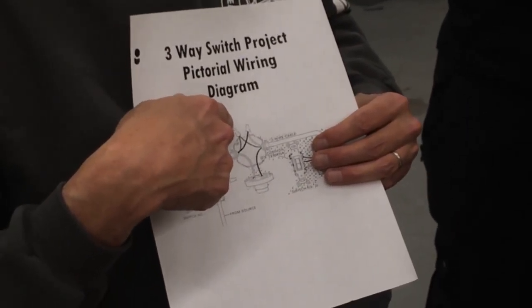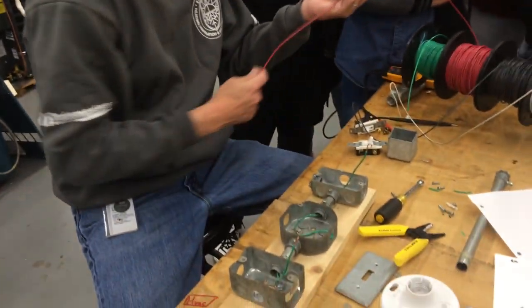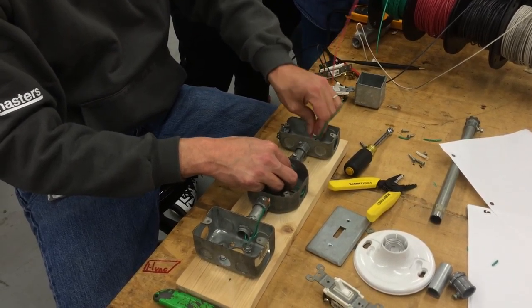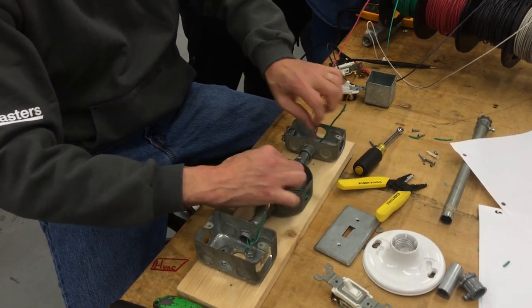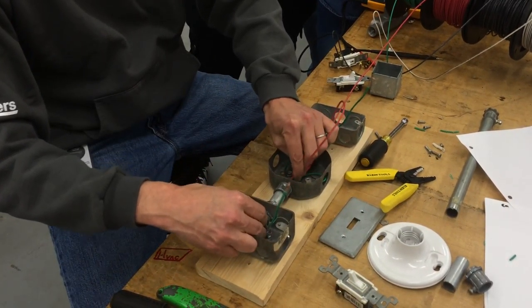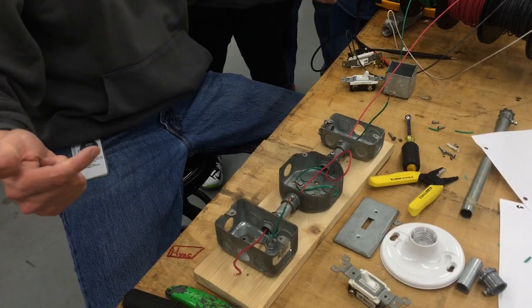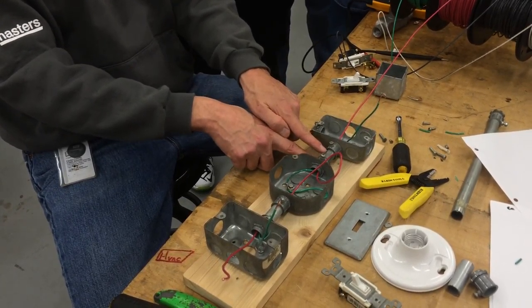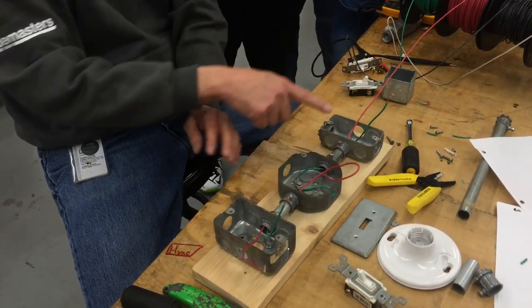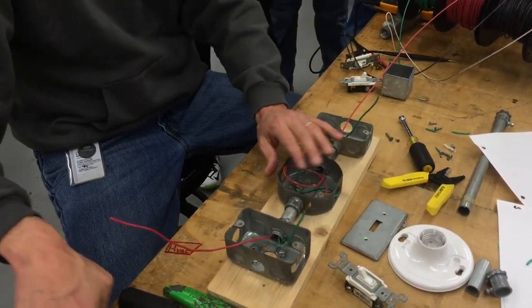On the diagram they have it tied with a wire nut in the center fixture box, but we're not going to do that because you're running the wire from one to the other. What I'm going to do with the red is just fish it through — you're just going to loop it, but you're not going to cut it. So bring it in, give it a little loop like that, and push it all the way through to the next box. If you used Romex 14-3 instead of the conduit EMT, you would probably need two different red wires wire-nutted together. But because we're running it through conduit with all one piece, you just loop it, push it down, and you're done. Don't need to cut it.